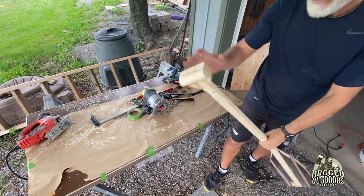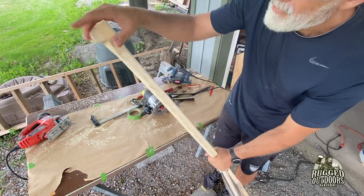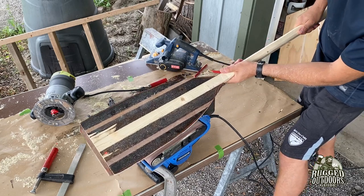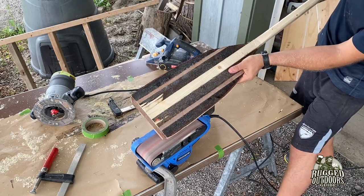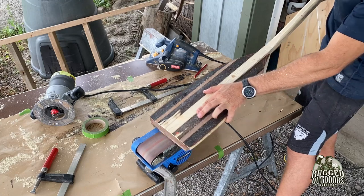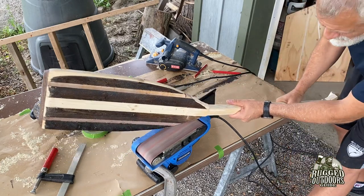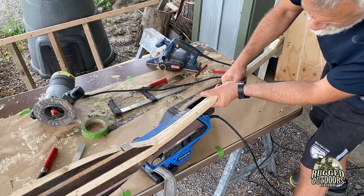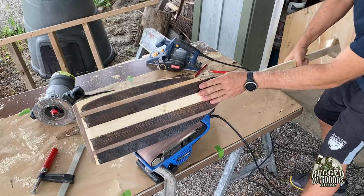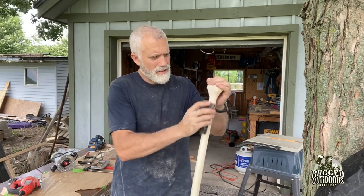With the blade angles cut and the handle ready for finer shaping, it's a very clunky, awkward tool at this moment. I flipped my belt sander upside down and went to town with the heaviest grit I could find. It did the job well but was sometimes hard to keep the sander in place with just a clamp — a bit awkward. If I could do this over, I'd use an angle grinder with a shaping disc and clamp the paddle in a vise, which would be much faster. I did more sanding than necessary because I didn't want to buy more tools.